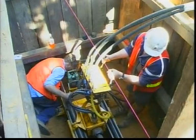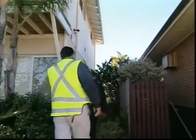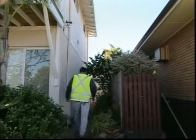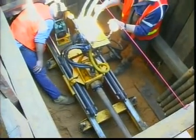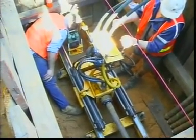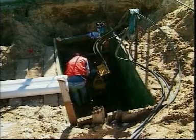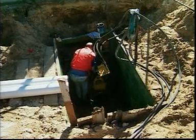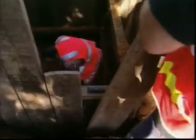The convenient size of the microtunneller is especially appreciated by contractors working in tight residential spaces. The 11B rig is narrow enough to be carried through narrow access ways, enabling access to almost any infill situation. A standard backhoe trench box gives sufficient operating width for the unit. A hand dug shaft can be used where there is no access for an excavator.